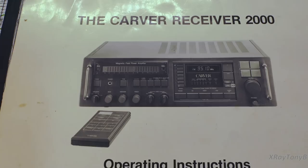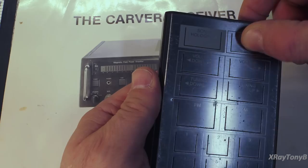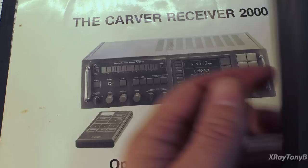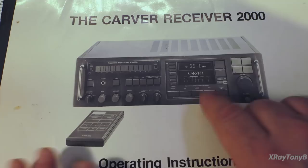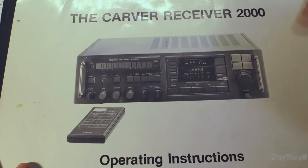He actually found one of these big old clunky remotes. It has an aluminum faceplate with these little three score marks, so this tab just kind of floats up and down, and underneath it is a little blister switch and infrared. What I've read from forums is that this amp was really susceptible to fluorescent lights causing false triggers - it was early infrared remote technology. In addition, he sent us a full set of knobs, so our receiver is getting dressed up.